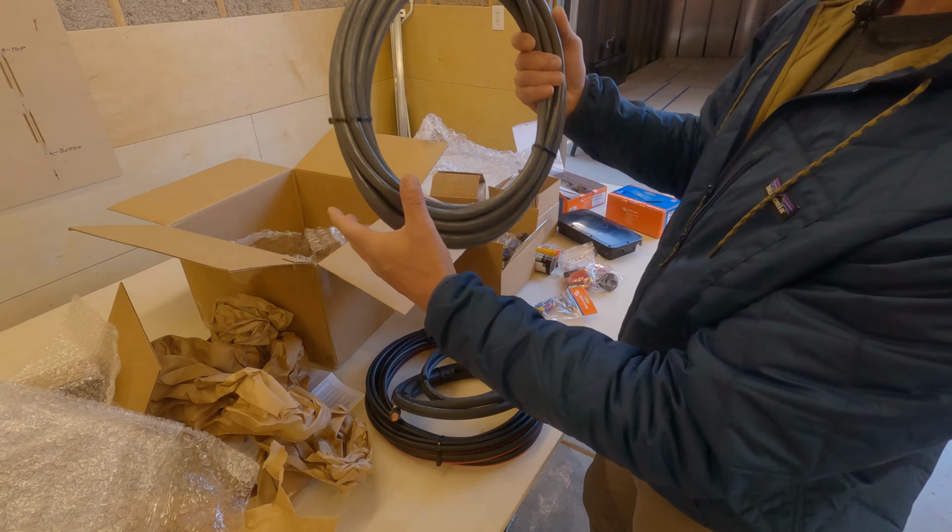Inverters are part of most of these kits. What an inverter does is it allows you to run AC or residential style appliances from your 12-volt batteries when you're not hooked up to shore power. However, after thinking about it, an inverter-based system just added too much for us. In order to take full usage of the abilities of the system, we would need more batteries. We would need a larger solar charger, probably more solar. The system ended up being too big, too complex. I really wanted a simple system.